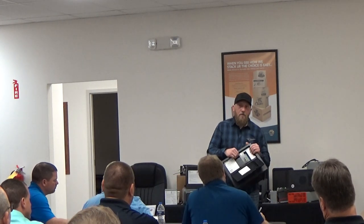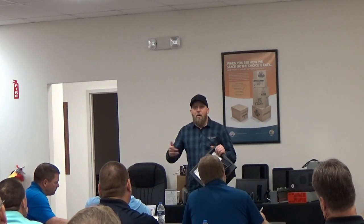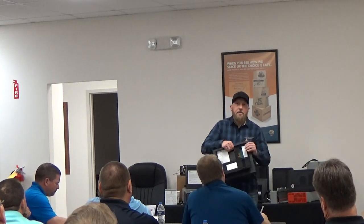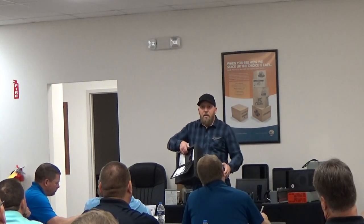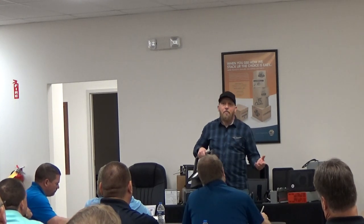But one thing you need to know is the RV comes first. So if they're running a whole bunch of lights, water pump, stuff like that, say they're using 20 amps in the coach, you have 35 amps available left on this one. So you have 35 amps available for those batteries. But it's not forcing anything on the batteries. The battery's actually taking from it.